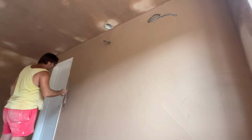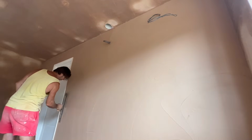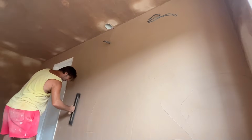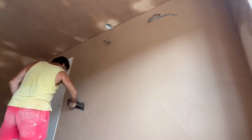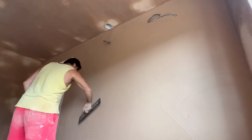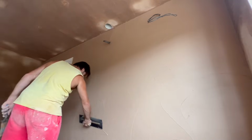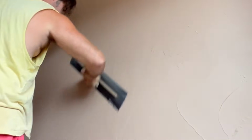So at this moment we can use what we're taking off, fill any holes. Of course, working in a systematic way so as not to leave any trowel marks, and that's what this big trowel is wonderful for, straightening out walls. Forces you to do them. So just if you don't know, put a slight little bit more pressure on the back, so we're creating a line there, okay, and that's what we're trying to work towards every time. Just smoothing it out. So we're working back to that all the time, chasing that little discrepancy.